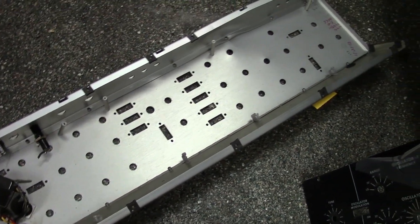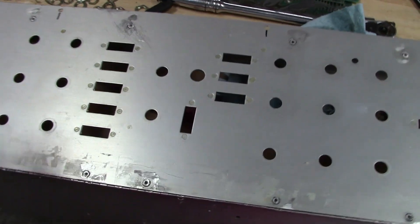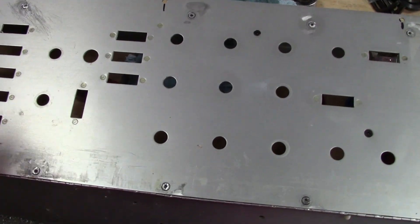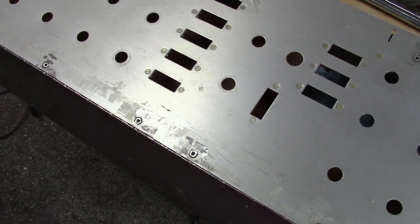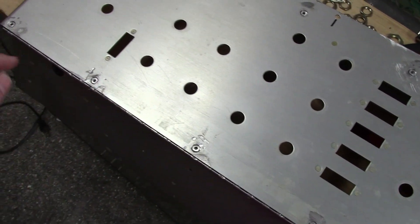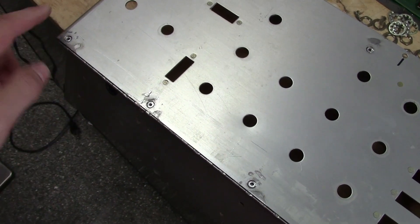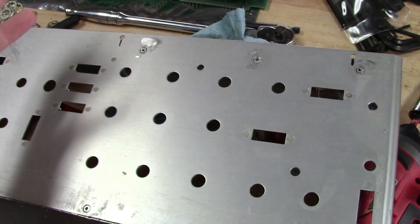Making some progress — this is the 5372 chassis that we're transferring the 33-44 guts into. As mentioned, the rivets had been replaced incorrectly and were sticking out so the interface panel couldn't lay flat, which is one reason I never used this chassis. I went ahead and drilled those out, replaced them, and ground them down so now they're all flush against the chassis. That's important so the interface panel can lay flat against the metal without being lifted by a rivet.